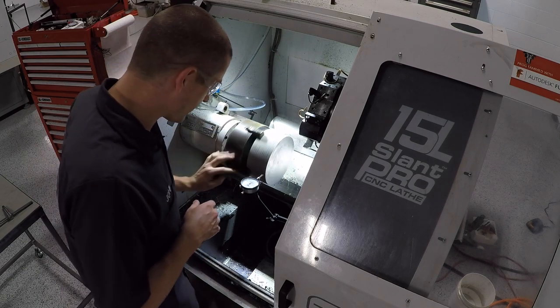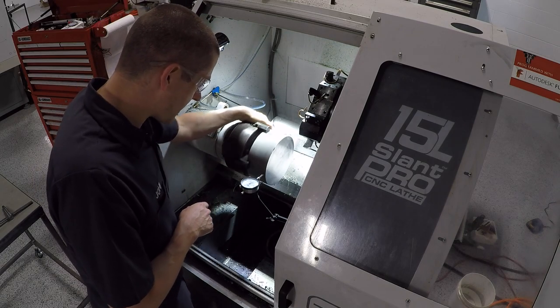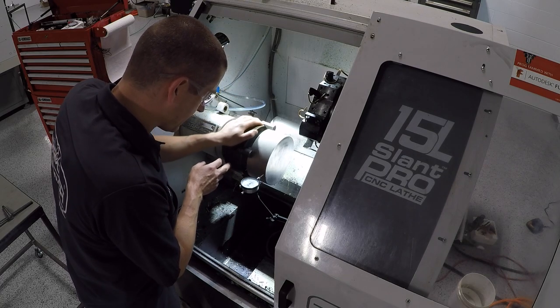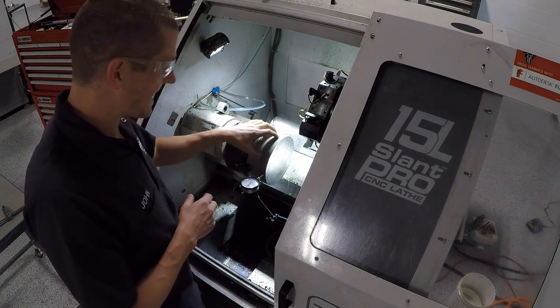Okay. So this is also what happened yesterday. I've got about 10 thou total runout on this 7.5 inch part, but it's not something I can dial in. So here we're 10 high, but it's basically like it's out of concentricity.